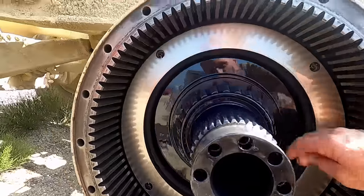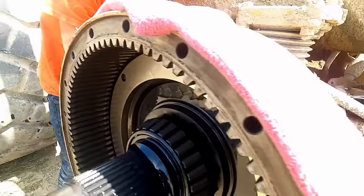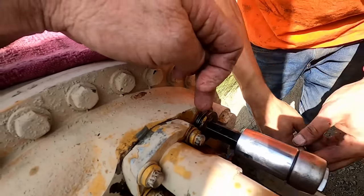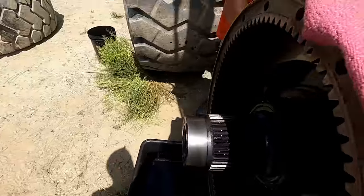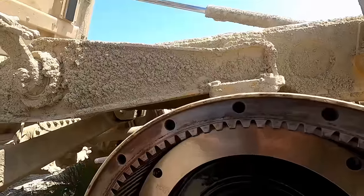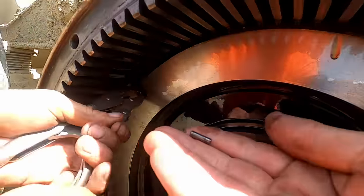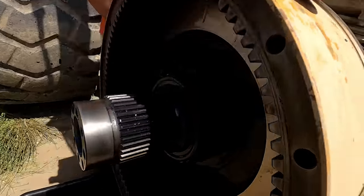Now we've got to pull the piston out to make sure it didn't get damaged when it was pushed out too far. To get the pistons out, we have to get the little lock pin out. There are four plugs in the back that take an Allen wrench — you pull those plugs out, then put a brass spacer inside and crank it in to push the pin out. The Cat engineers made it so you can't do it without their tool, but we put vice grips on the pin, give it a jerk, and the other pin falls out. There's the pin and the spring. We'll get all four of those released and then slide the piston out.